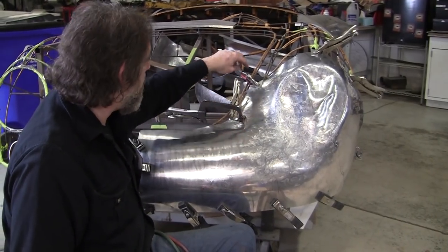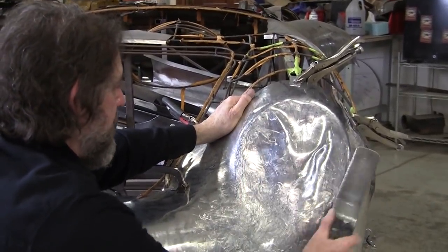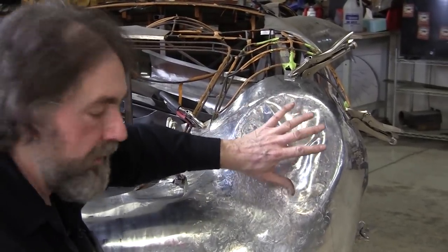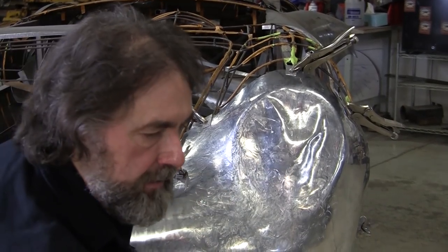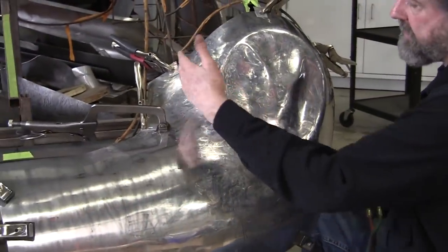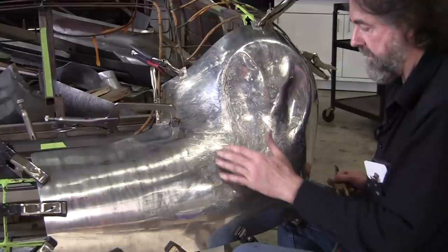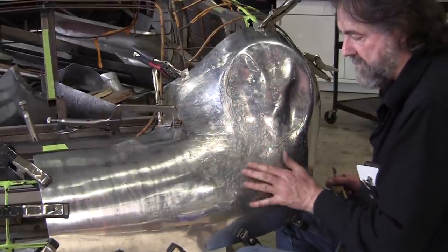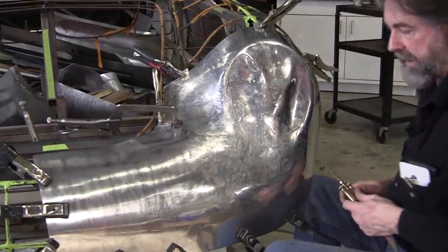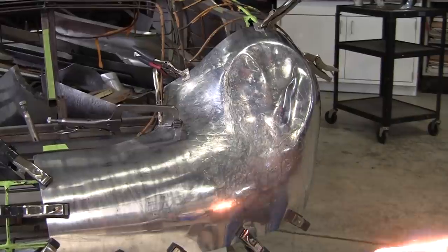Okay, now we put it back on and I've put some of my clamps with these little protectors. They protect the panel. And I just slapped it a little bit there, and all this excess metal in the center, where it's gonna be cut out anyways, but I don't wanna cut it out now. I could shrink that down. And it's pretty close to the wires, except for right here. We had a situation where we were shrinking this, and it caused it to migrate somewhat because we're not clamped really thorough. So it migrated down here. We took most of it out of here, and it's migrated a little bit that way too. So slowly but surely, we'll get all these migrations under control and let the metal conform to our wishes.